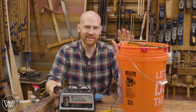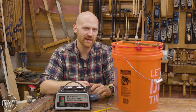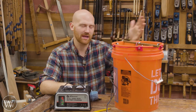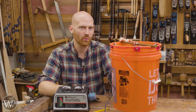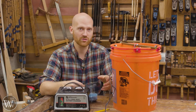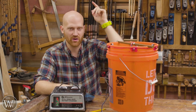So there you go — we have our electrolysis bucket and a way to set it up. One of the nice things about this is if I put these bolt holes down a little bit lower I can put a lid on it, seal it, and use it next time. Most of the time when I'm using it I'm doing a whole bunch of parts, so when I'm done I just dump out the water. It only takes about a half cup of washing soda to make this, so I'll just make up a new batch each time. I really don't do this very often — it comes out maybe once a year or once every two years because there are other methods I like for taking off rust. If you want to see those, I have several videos on how to restore hand planes and tools and I'll go through rust removal on all those. But this is a fun one that a lot of people really like, and all the parts and pieces are down in the description.